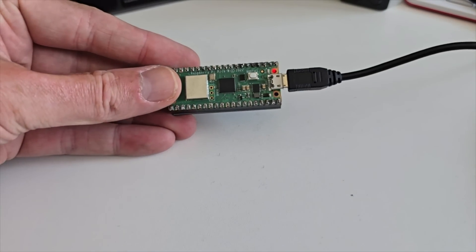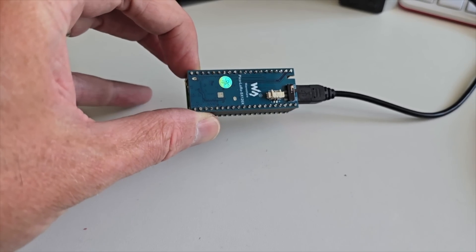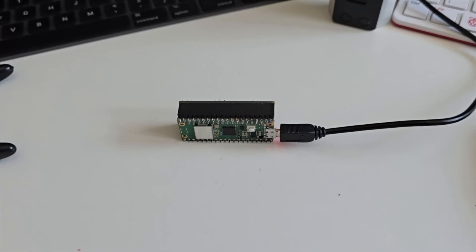We're going to use a Raspberry Pi Pico because I've got loads of them, with the Waveshare board. These are really low power — pretty much nearly as good as the RAK stuff for power consumption. I'm going to run it off a big battery down a wire and put it at the bottom underneath the tree in a waterproof box, which should hopefully power it for as long as possible. The good thing about the Raspberry Pi Picos is they've got Wi-Fi on board, so I can connect to the Wi-Fi network and configure things that way. Here's the Pico I'm going to use — it's already plugged into the computer with the Waveshare board on the back.